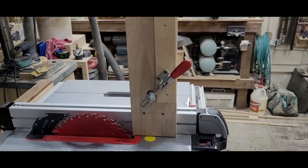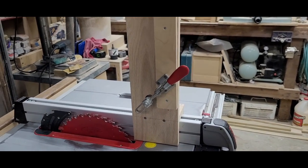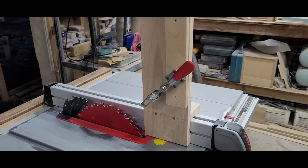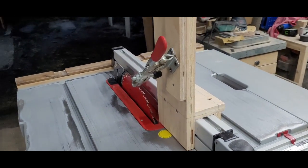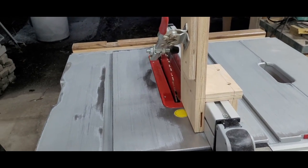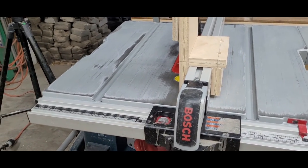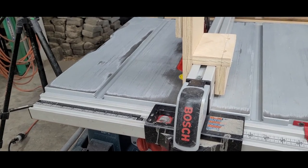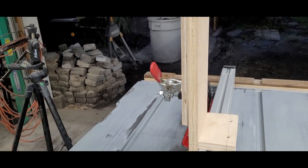The blades on the spatulas are still too chunky for my liking, so it's back to the table saw. To start with, I put together another version of my tenoning jig. I honestly thought I had done a video on how to build these earlier, but I guess not. It's basically a tall fence secured to a piece of stock that rides on the top of the saw fence, and a third piece that holds them snugly to the fence.